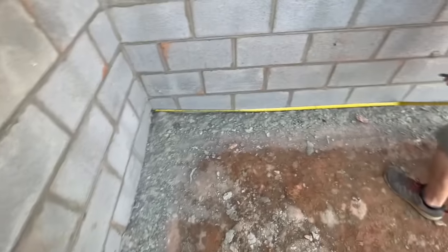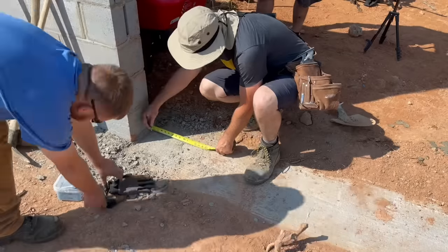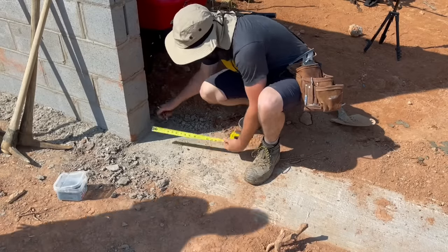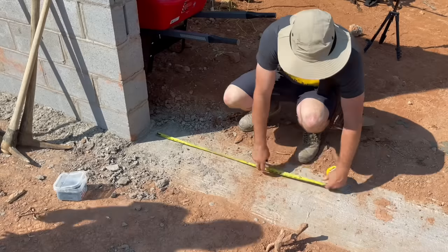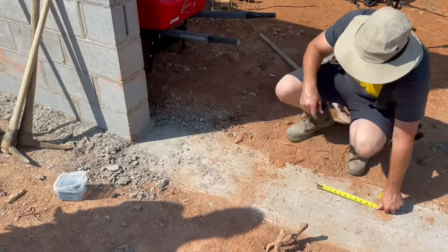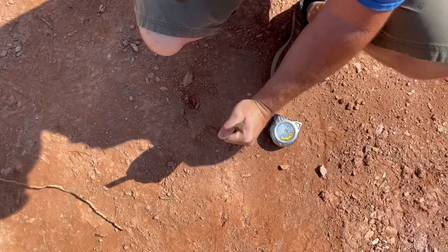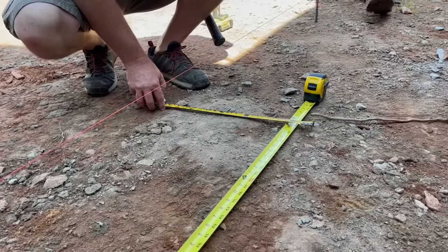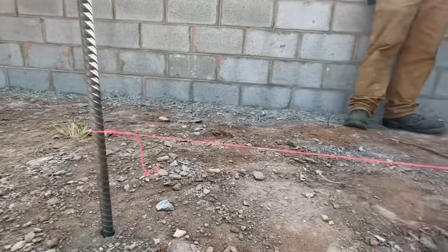Up next, we got going with our slab plumbing, which is actually the plumbing under the slab, which is all drain lines, so that this place can gravity drain down to the septic tank. I started with doing a little measuring and double checking since my plumber pointed out a few dimensions were missing off this basement level that he needed to go ahead and put pins that would represent the inside or outside of some of the walls in the basement.